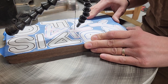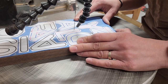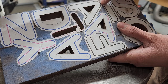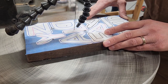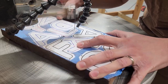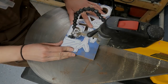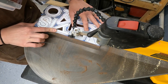Now I'm ready to cut my letters on the scroll saw. When we cut them out on the birch we cut on the outside of the line, so now I'm going to cut on the inside of the line, but I'm not going to follow it on the left side — I'm going to follow my line on the right side so my blade kerf comes out on that side. That way my letters don't become too small and wiggly within the puzzle. If you'd like to see how I designed this puzzle using Inkscape, I will leave a link in the description.